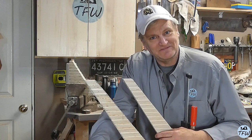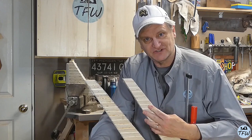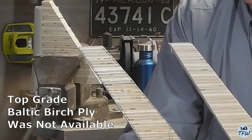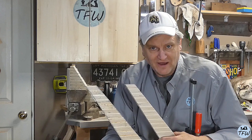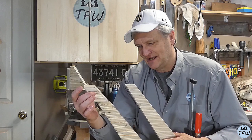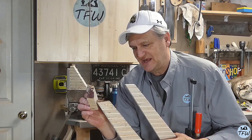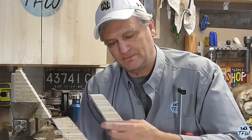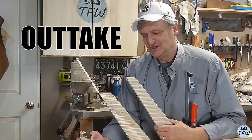Talk about the best laid plans of mice and woodworkers — sometimes you run into trouble in the woodshop. I really like the look of this plywood, but this was just home center birch plywood, three-quarters inch thick, seven ply. I bumped into it while sanding and snapped a piece right off. It's not that tough side to side — the glue held, but it actually broke on one of the plies. I'm going to try to make this work and stiffen up the whole structure with some epoxy. That should soak into the wood fibers and put a hard plastic layer on the outside to toughen the whole thing up.